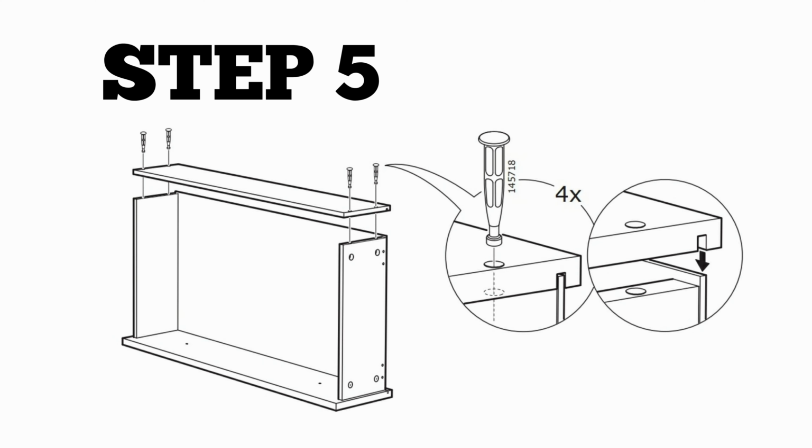Now let's get our middle support bracket and our two really small screws. First, we're going to screw this screw into this hole, but we're going to make sure we don't screw it in all the way. Then we're going to attach our bracket to the one screw like this. Then get our other screw and screw this one in right here. Now, if you take your completed drawer, this one with the safety label goes on the very top. You can slide it in like this.